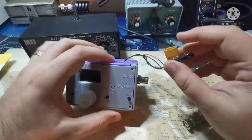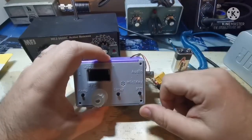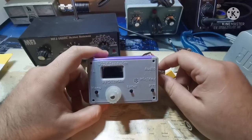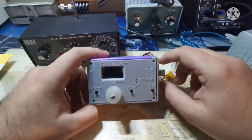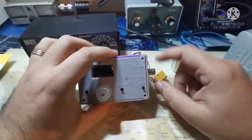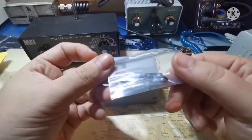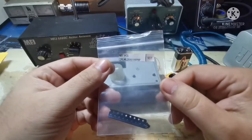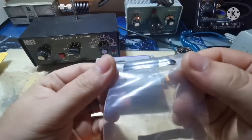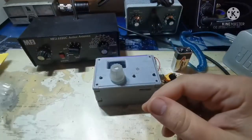Here is the cable for putting in power. It's well known that class E radios do not support too much SWR, so you need a very good antenna — about 1.2 to 1.5 SWR maximum. If you go over 1.5, you will burn the final drive. That's not a huge deal because it uses small cheap final drives, the IRL2060 — I paid about five euros for 10 pieces.